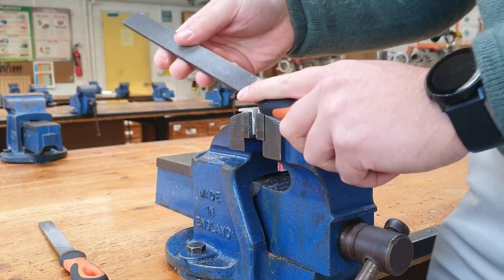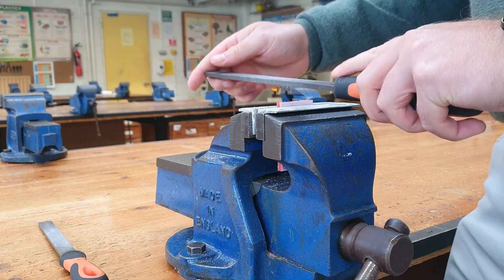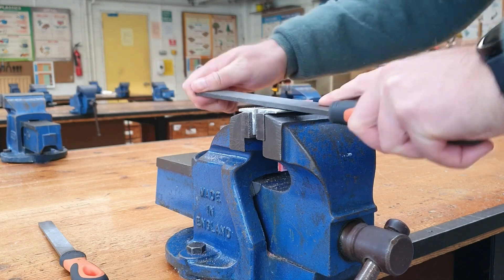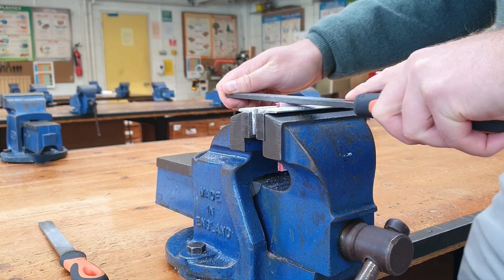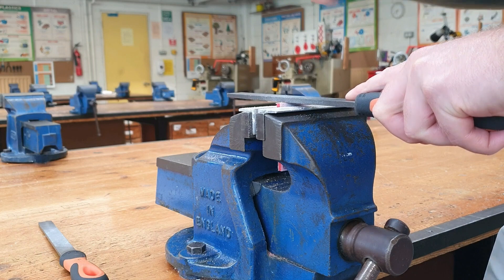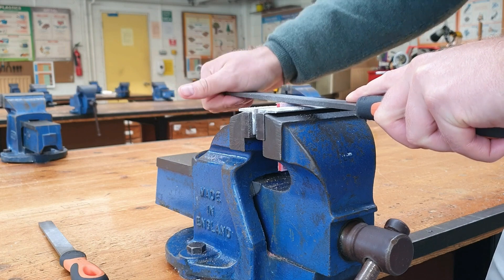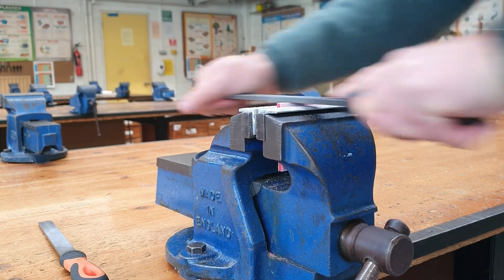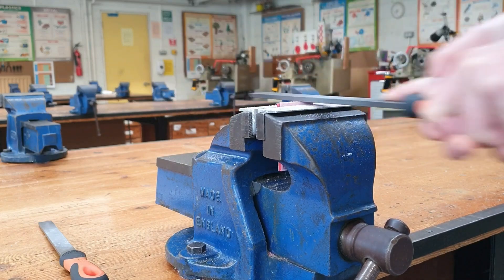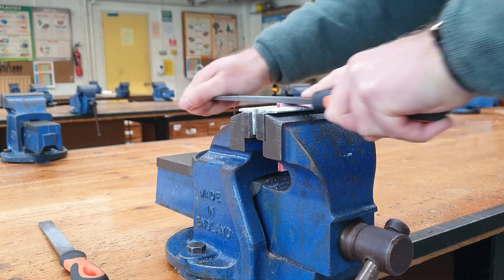When we're filing — I'm left handed so my left hand is on the handle, and my right hand is placed on the top of the file. I have a boxer stance and I approach the work piece like this, and my file moves back and forth across the piece. This filing technique needs to be done standing up. The hand placed at the top of the file is almost more important than the hand at the handle. If you apply pressure with your hand at the top, material gets removed a lot quicker than if you were just sitting and rubbing the file across. So apply downward pressure with your boxer stance as you move the file across the piece.